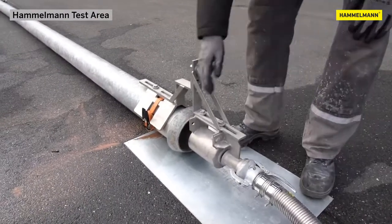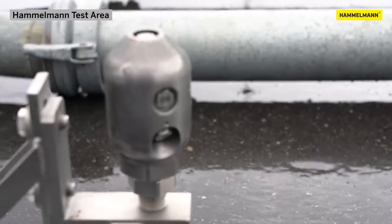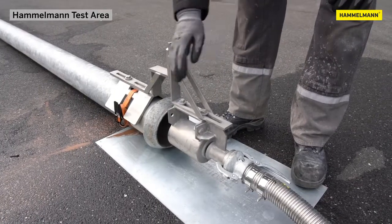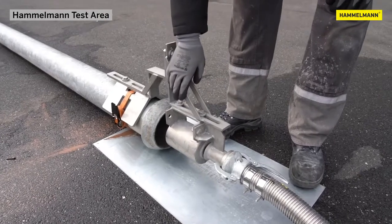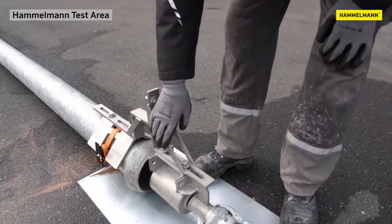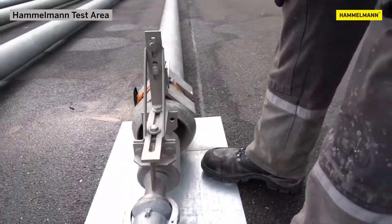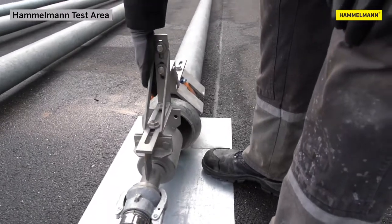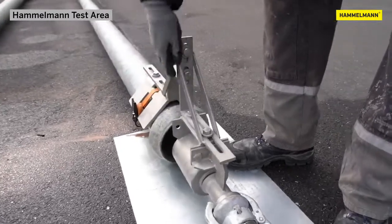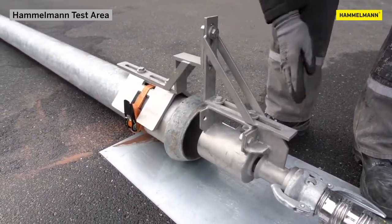On the one hand, the safety device consists of a quiver tube. The nozzle is currently placed in the quiver tube, and the cleaning process starts from here. The big advantage of this is that the nozzle can no longer backfire out of the pipe, so it cannot unintentionally come out and cause injuries or damage to other components while under pressure. And you can clean your pipes seamlessly, which means that nobody needs to manually clean using a blasting gun. We pass the first inch of the pipe with full cleaning power and pressure.